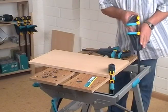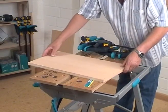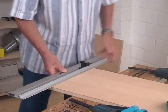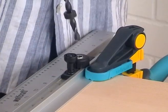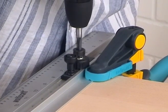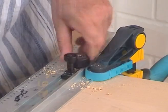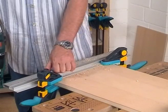Please turn the side wall 180 degrees so that you can drill the opposite dowel holes. Finally, apply the doweling jig again flat and push the side stop against the marked edge of the board. Starting from this edge, once again four dowel holes will be drilled. Please take care here that you use the same drillings or raster.